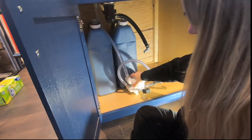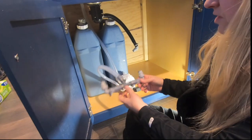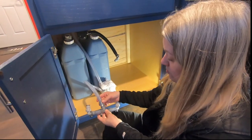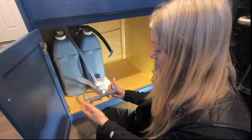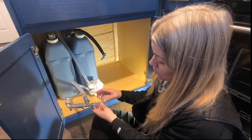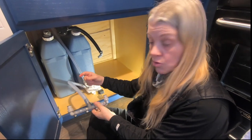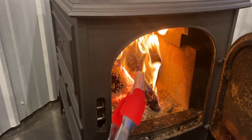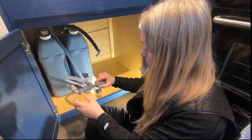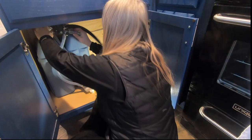I've installed the Whale Gusher pump, and this is what's going to draw the water out from both of these tanks. What I did is I went with basically a T-fitting — a barbed half-inch barb on each side — and then attached the other side of the quick disconnect with a small piece of tubing. One tip: on some of these fittings, the hose is really hard to get on. You can help yourself by heating these up — use a hairdryer, a heat gun, or in our case, because our wood stove is right there, I just stuck it in for a short period of time, heated it up, and was able to jam that hose right on. Then I'll just attach these behind here, and those just clip right in with the quick disconnect.